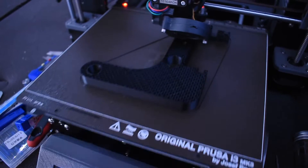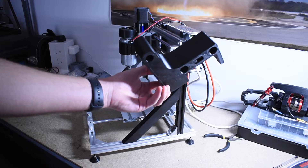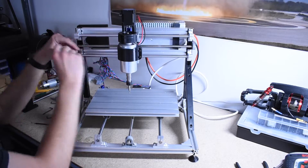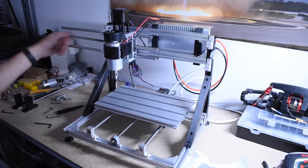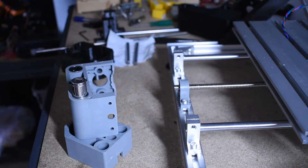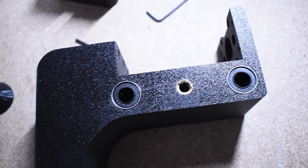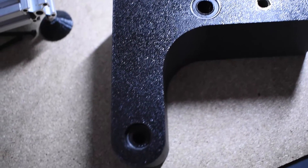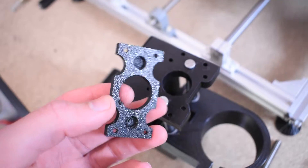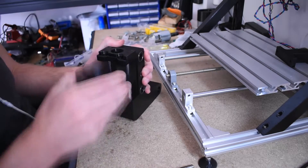I got these things printed in black PETG — the finished result is a nice-looking print, nice and bulky, which should give us a lot of strength and rigidity in the x-axis. The next job was to disassemble the x-carriage and take all the z-axis parts apart. This can take a while — it's sometimes difficult to get those rods out and especially the bearings, which you have to tap out carefully using a mallet. You then place those bearings into the new part along with the z-screw. The previous design had smooth rods that could just fall out, but now I've created a cover that snaps over and bolts down — it's not going anywhere.